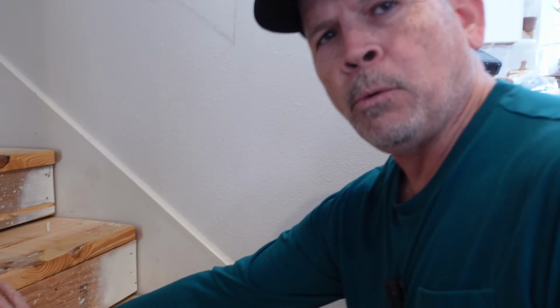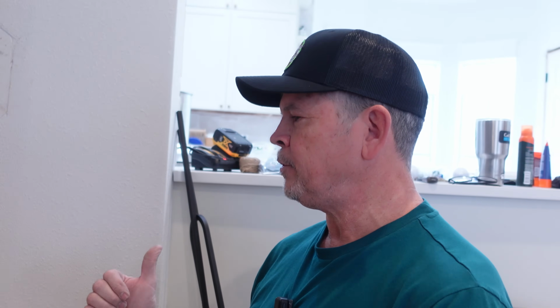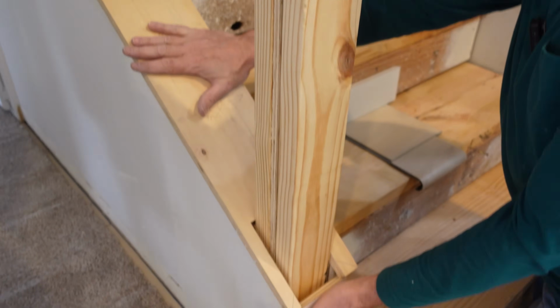So we are going to use plywood for our risers. We got 2 sheets. Summer's going to give them 2 coats of our trim color. That's going to save us a lot of cutting in later. So while she's doing that, Rad and I are going to work on this cap and this waterfall edge right here.